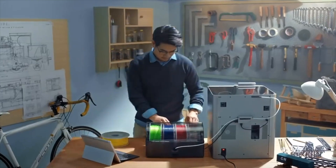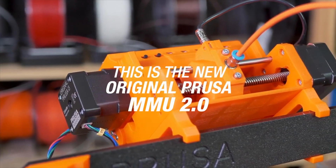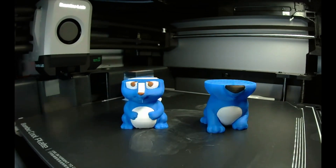Today in the market there are printers like Bambu Labs with the AMS, which is a system that feeds different colors through your printer. Prusa has had it for a long time with a multi-color attachment that goes on top of the printer. Even open source projects have these systems — for the Voron there's something called the ERCF, which is exactly the same functionality: different spools fed to your printer, automatically cutting and purging depending on which color you're using. But I didn't want to go that route since I don't normally use multi-color printing that often.